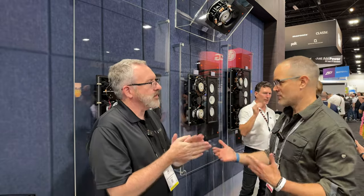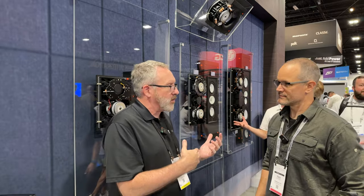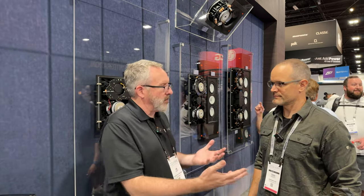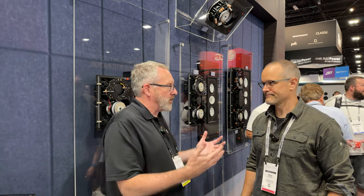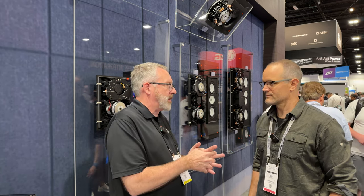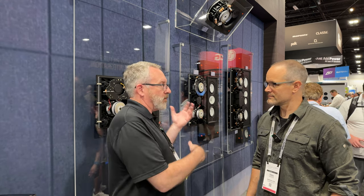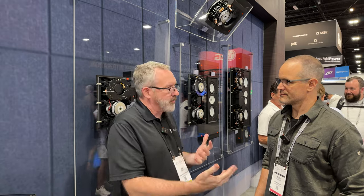Yes. So you have some in-wall box options. Yeah, there is a back box that's optional for all four models. So you can use them without, if you don't want to have that enclosure in there, or you can purchase that as an additional option and put them in the wall ahead of time. And then you've got consistency from room to room. The sound quality is always going to be the same. You can, of course, minimize room intrusion into adjacent spaces, anything like that that you want to do. The bass performance will change a little bit with them versus using them in a larger stud bay enclosure, if you will. But again, you'll get that consistency out of them. So they're sold separately. It's an option for each of the models.